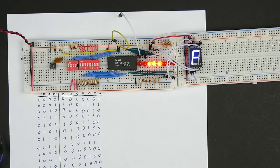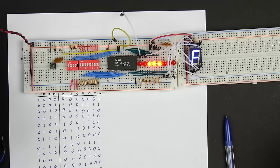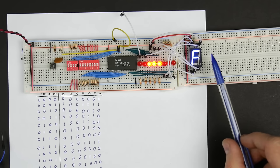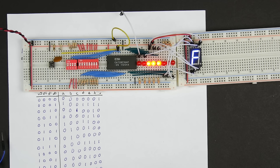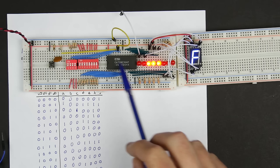Programming with individual jumper wires isn't super fun, but it's a lot more fun than designing and building the whole combinational logic circuit, and certainly much more flexible. You could use a couple of these ROMs for each digit to do a decimal display. In the next video I want to cover a much faster way to program these chips — building a proper programmer — since we'll be using several of these EEPROMs in both the output display and the control logic of our computer.